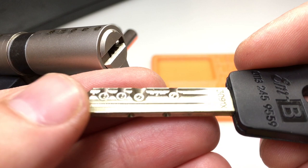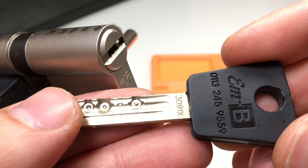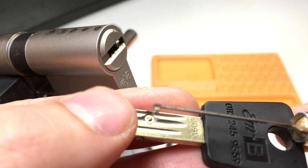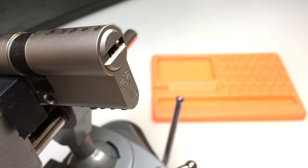But if you can imagine just how high that pin is inside — it's very hard to get past. Then we've got one which needs to be pushed almost all the way in, and again with the outer, the inner pin just being set a little higher. And then we've got that really awkward pin where we have an inner pin which needs to be set almost a millimetre lower than the outer pin. The only way to do that is by using a tool like this. Pete Restall — go check out his channel — gave me that tip where you get a curved dimple flag and curve it in over the top of the pin to pick that pin itself.